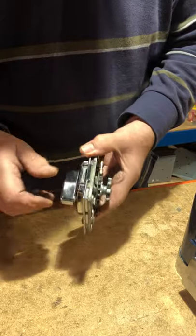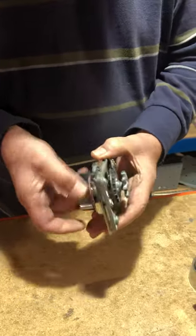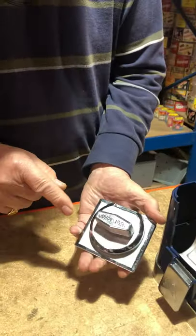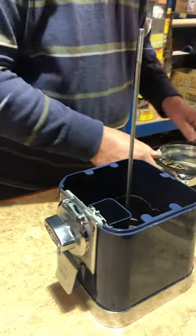Then there's the coin mech. I do check these — I put a 20 pence coin in there and check it's going around, check that all the screws are there, that it's flicking back nicely, working nice, and it's clean — it's all been cleaned. So that's ready to go.